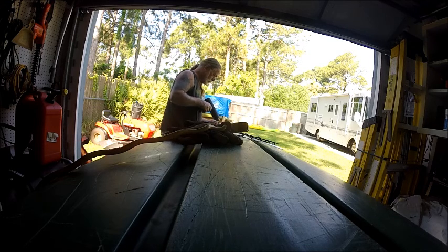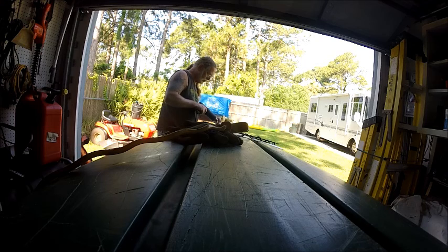Once I got it prepped, I'm using a heat gun to get the entire area warm. The gun I'm using is a paint stripper, so it's substantially hotter than a hair dryer. So I'm continually moving the gun around the work area so that I don't burn through. As I see the kayak material start to melt, I keep moving it around.